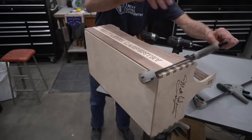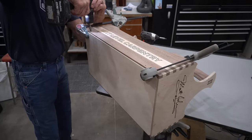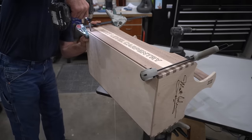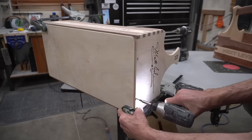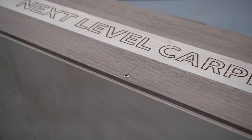Next, I slip the bottom panel back into place and hold it there with a couple of squeeze clamps while I use an 1/8 inch snappy bit to pilot and countersink holes for the number 6 by 1 inch oval head stainless steel screws I use for holding the bottom into place. And I'm careful with these steps to make sure I don't over countersink or overdrive these screws, leaving the oval top heads just proud of the surface.